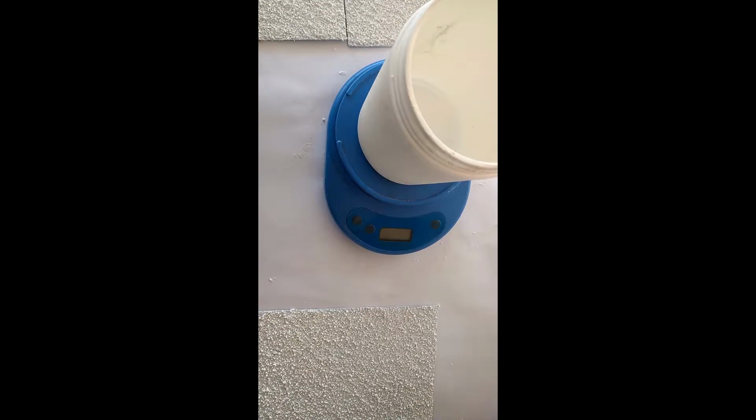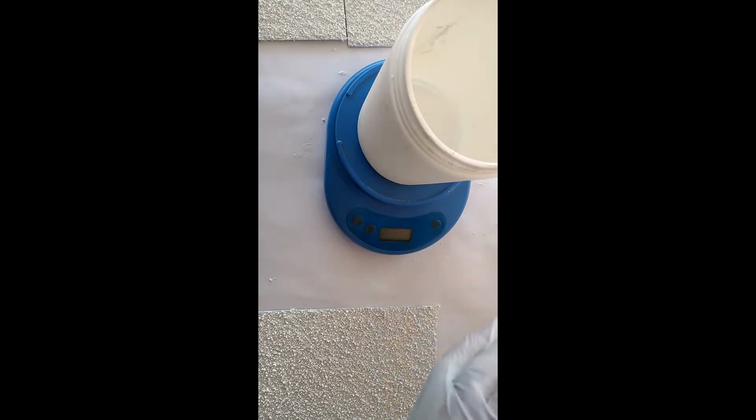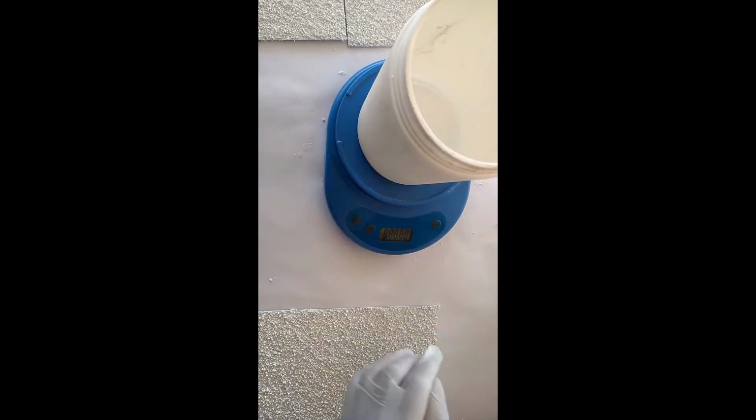We are going to prepare the mixture for the sealing of the grains, which gives rise to the finishing of the plates. If it were a large installation, it is done the same, only on another scale. In our case we need a scale and a container for the mixture. The ingredients and the order are the following. First, water, 200 cubic centimeters, which is the same as 200 grams. In the kit we have a graduated bottle.